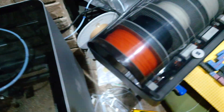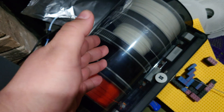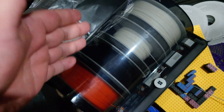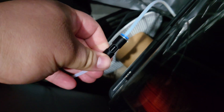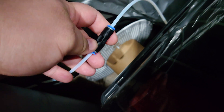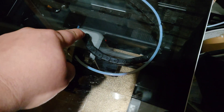But what if you have the AMS system? Won't it shove air all the way back into there, exposing the filament to more moisture trapped in the system? No — they've thought of that too. This little inline adapter releases pressure coming through that side, so it never gets fed back into your AMS system. It only goes one direction: toward the extruder.